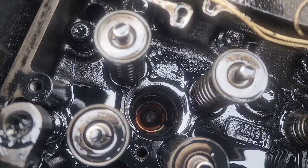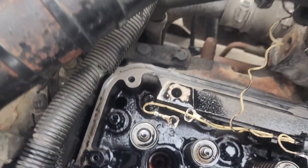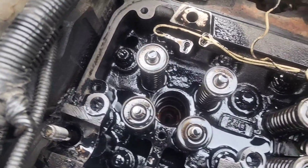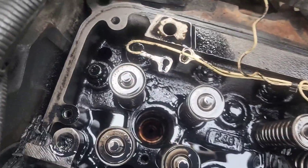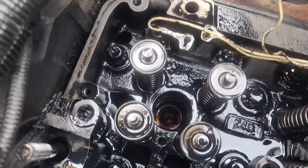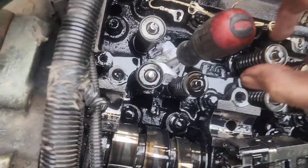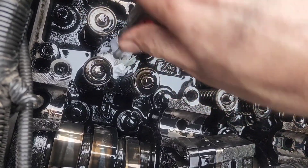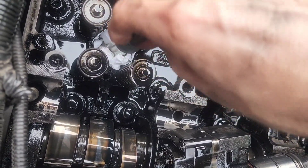Fuel's going into the cylinder — we're going to crank the engine over slowly. Fuel's going to come back up through the injector hole — here it comes, approaching top dead center. Got some of the fuel to come back out of the injector hole. Put paper towels in there and press the flathead in very lightly — not rough — turn the paper towels, make sure the flathead's not bumping the metal. Do it a couple times to clean it up and soak up some of that diesel.